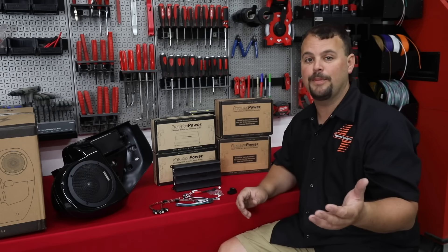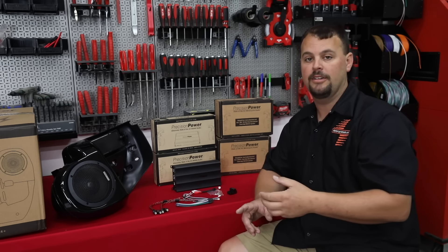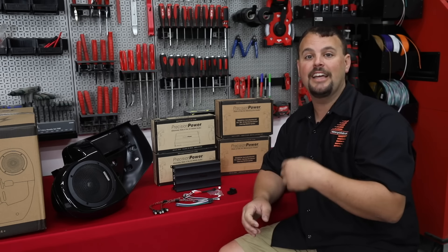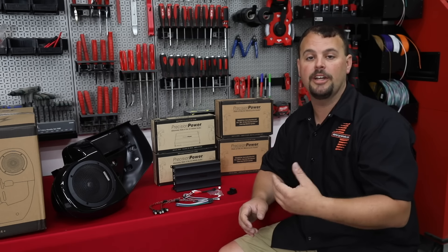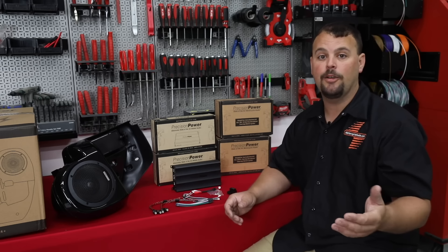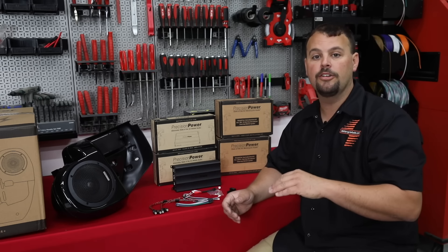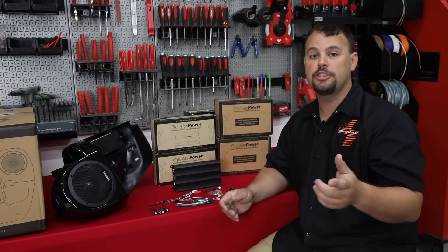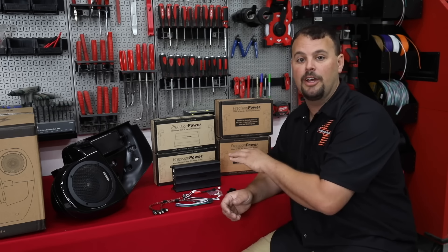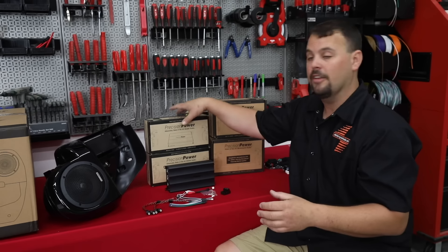If you have a CEA-spec amplifier, they've used 14.4 volts of input current. They've done a 4-volt input signal and less than 1% total harmonic distortion when they give you their wattage specs. So that means when they give us that spec, we can know that it's going to actually probably be an underrated or undervalued number. We'll show you later in future videos — I've got great plans of putting this on our amp dyno, showing you the real numbers. I've seen the results and I'm excited to share them. But let's get back to the amp.